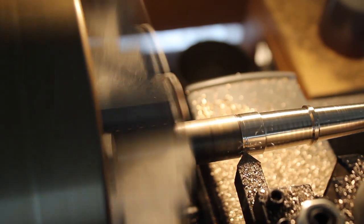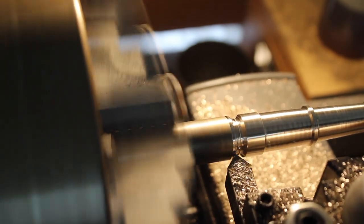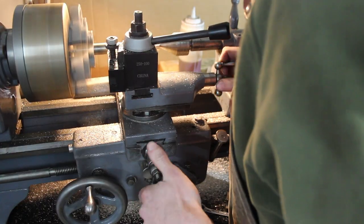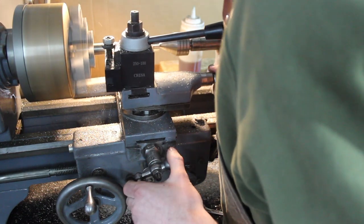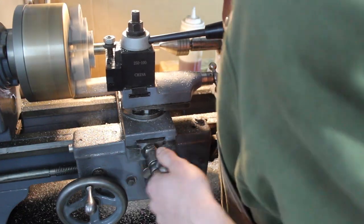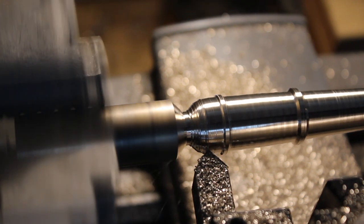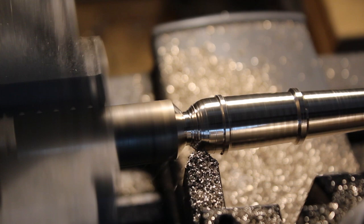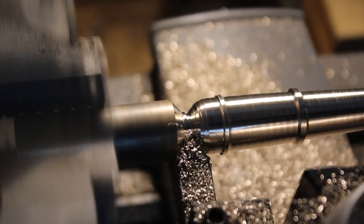With the front mostly shaped out I moved on to the back, where I wanted a nice little radius. I actually built a ball turning attachment a while ago and thought about breaking it out here, but for just this one little piece I decided to just try and freehand it. It actually worked out pretty well — I was happy with how that worked out. All I really did was run the tool right up against the edge until I found the radius I was looking for, and then tried to do a finishing pass going really slow to get that shape as close to a radius as I could, just by hand.